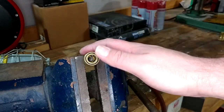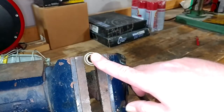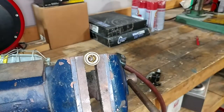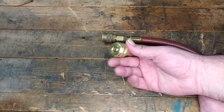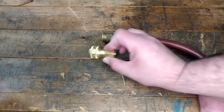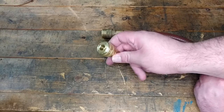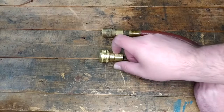That's a no-go, at least the way I'm using these — I admit my compressor is killing them, not them killing themselves. And so is Indiana's climate — it's super humid here and I'm always going to be passing some amount of water through my air. So I'm going to make good on a promise from several months ago and start switching out to Parker fittings. It's almost not even fair to call these two competitors. First off, there's just plain old cost — this Parker probably weighs about twice what this Milton does, so there's easily half again more brass in it. These are like five or six bucks, while this guy was like $15. If there's a local Parker hydraulic store, I might be able to get them cheaper.